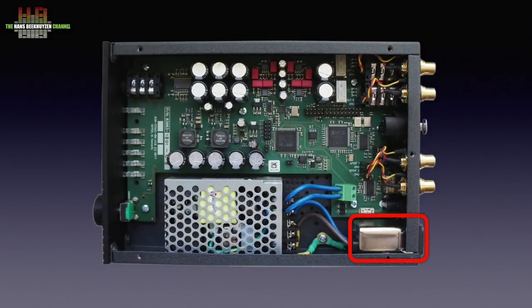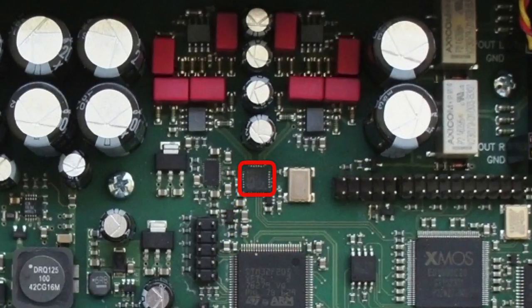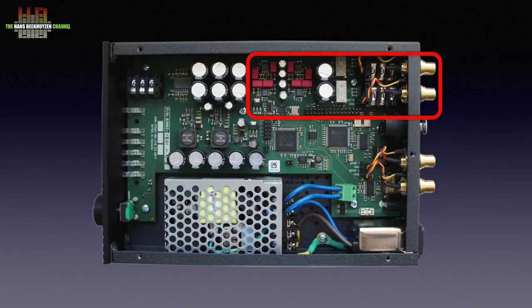The mains inlet, bottom right, already has a mains filter before it feeds the switching mode power supply in a metal case. If you're afraid of switching mode power supplies, this section cleans up and stabilizes the power for separate parts of the audio electronics. Inside we see the well-known XMOS chip plus remarkably two clock oscillators, then the ARM processor that presumably handles filtering including MQA, and the very tiny ESS Sabre ES9018 K2M DAC chip with the clock oscillator very close by. Finally, the analog section converts current from the DAC chip into a voltage, and this section also appears to have separate power regulation.